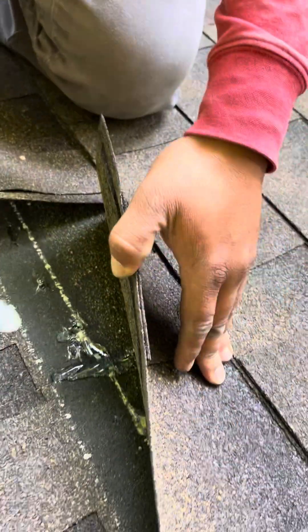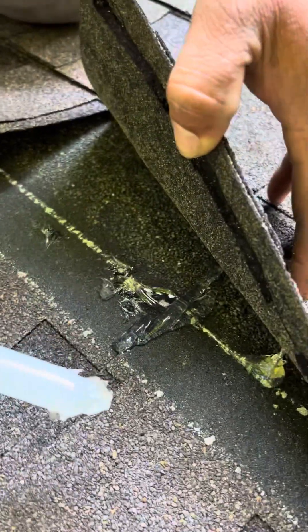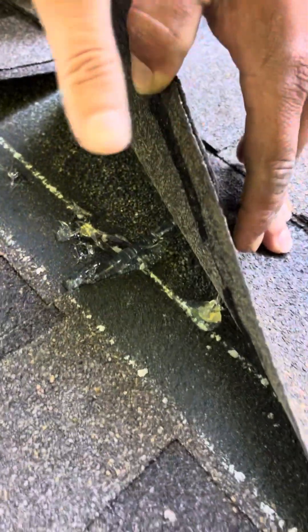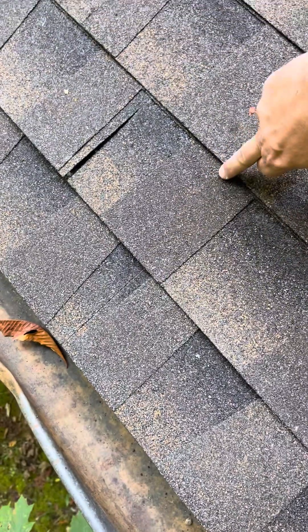So our solution that we were going to do two days ago was to do this. But we put the silicone on top on some of the shingles and not on others, because we didn't understand perfectly. So we're going to caulk this nail and caulk this union that's around six inches away — and that's how you put shingles down, that's every single shingle manufacturer. We want to seal underneath so that no water can go on the nail that's right here, or the shingle that meets six inches over.